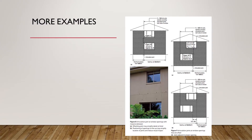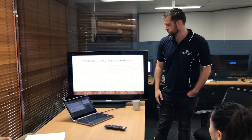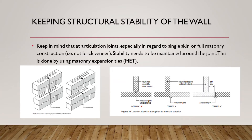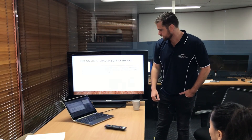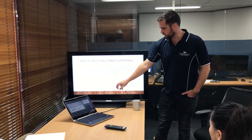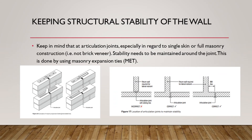What we've got to keep in mind is that if we're putting a physical joint in the building, we still need to keep the structural integrity of the brick wall. If we're relying on a double brick wall to provide a shear wall or some sort of bracing, we've got to make sure we have consistency through the brickwork — that's where MET ties come in. These ties physically move to allow the brickwork to move but also hold the stability of the wall. I've probably specified crimp ties more often than not. We've got to make sure we're putting these details on the plans, and if there's a shear wall, we don't want to physically separate that wall — put the brick joint away from it. The standard says you can go up to 300mm away.